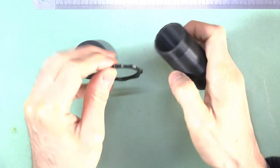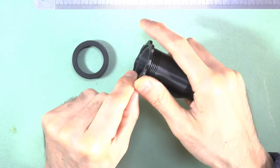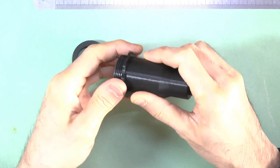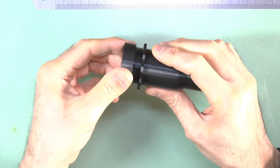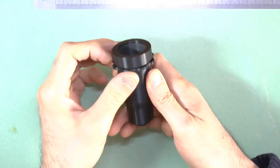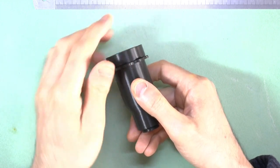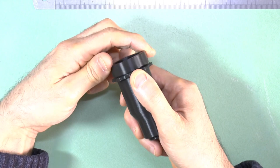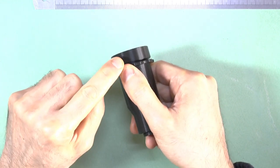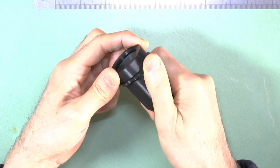When it comes to assembling, put the lock nut on first. This is the top surface and this is the print bed surface — put it on with the print bed surface first and that goes all the way down. Next, thread the ocular cap on all the way down. Then locate the seam on the cap and mark its position. Unscrew the ocular cap by one full turn until you see the seam come round again. This will set the default ocular cap gap or OCG to 2mm. Now fix the cap in place with the lock nut. And that's it.